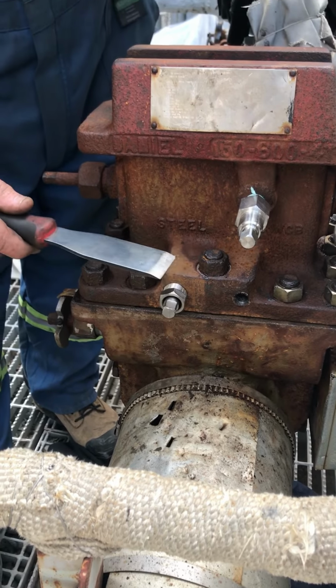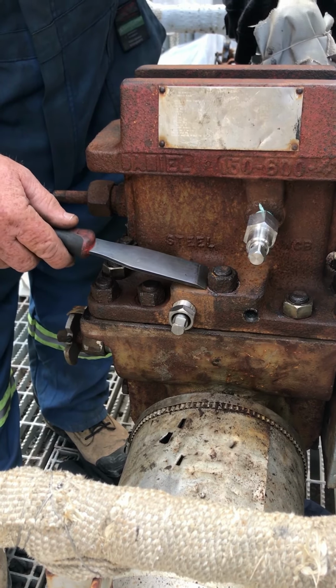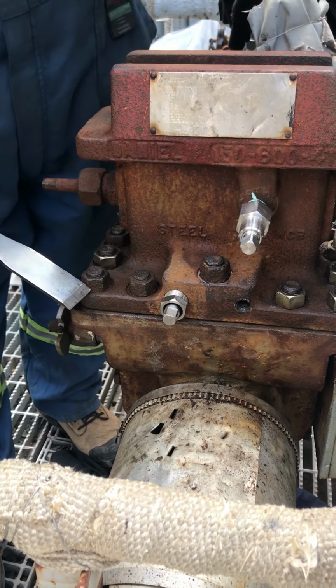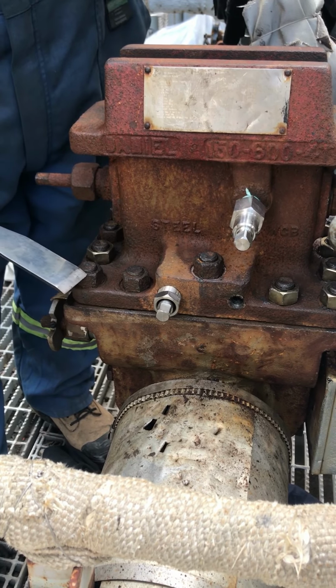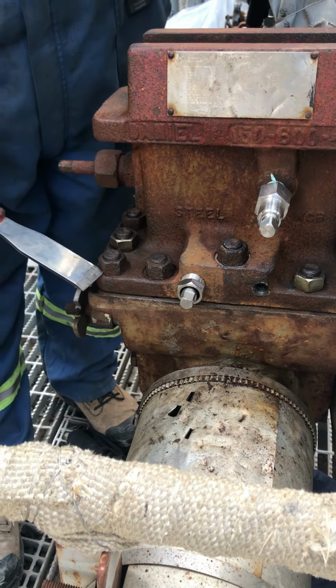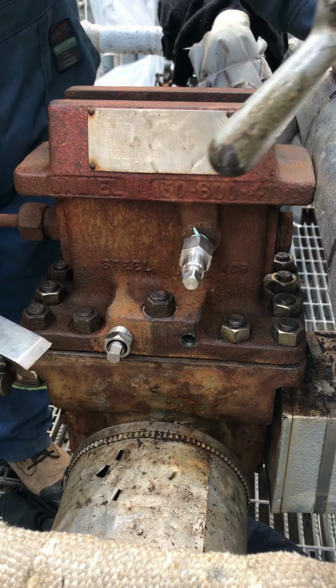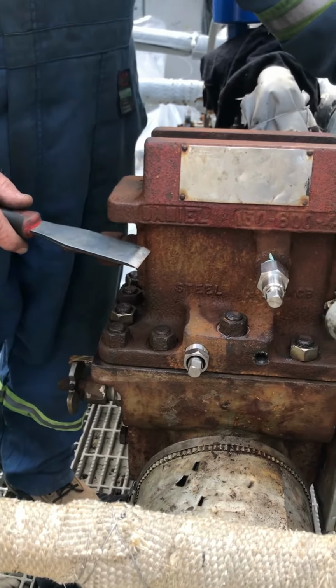All right? By spec, if you tighten this down correctly, you don't need to tighten the corners at all. That's how much of a seal you get. So stay away from the corners. All they'll do is give you grief, if you have a leak. I've never had one yet. You put the dope, put it on tight, and tighten it down the way we have. Not an issue.